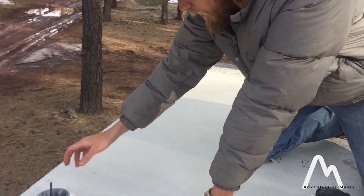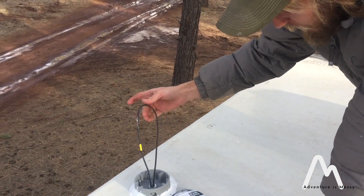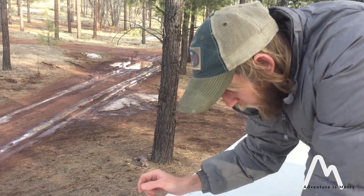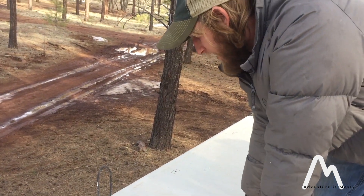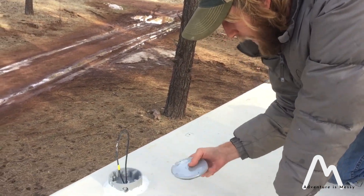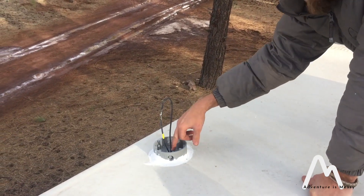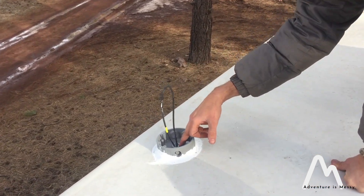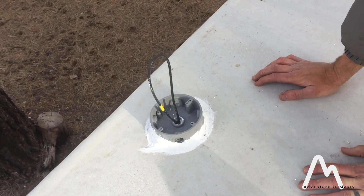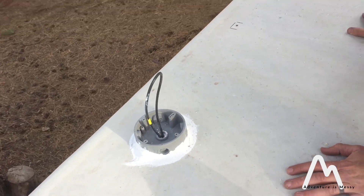Over here I've already done this — this is the cables where it's going down. It came with the 12 gauge cables, so one of these is positive, one of these is negative. I'm going to cut it in the middle somewhere. I think the negative doesn't need to be as long as the positive, so I've marked which side I'm using for which. And eventually I'll cut this and tie it into the panels, probably leave a lot more room on the hot side. This is just a little plastic weatherproof case for conduit. I've knocked out one of the blocks in the middle here, and that's where I actually drilled my hole down. Then there's two screws, one on each side, that I've siliconed up. And I've knocked out one of the side knockouts — that's where this wire will actually go through and then sit up under the panels real nice.